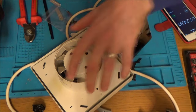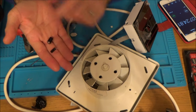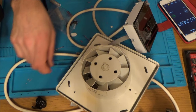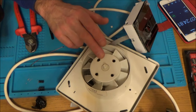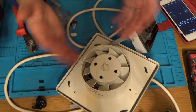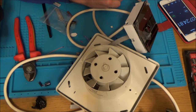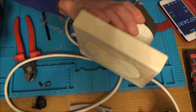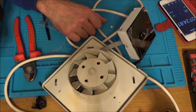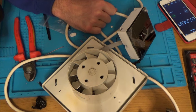I really enjoyed doing this one, and that's because it was easier to get your head around with a smaller circuit board. It's nice to just replace two capacitors — even though they don't look damaged, these were the things causing the faults. By spending less than one pound, the fan is now working. It has already been up for around 15 years, so it might be possible to get another five or six years out of it, depending on the bearings and that main resistor. However long it lasts, it's still a bonus. Obviously if your time is precious you might want to think about how long fault-finding takes, but at least it saves this getting thrown away and gives it a new lease of life. Hopefully you enjoyed this video — I'm going to give this back to my brother so he can install it back in the bathroom. Please give it a thumbs up and subscribe for more trying-to-fix videos. Take care, bye now.